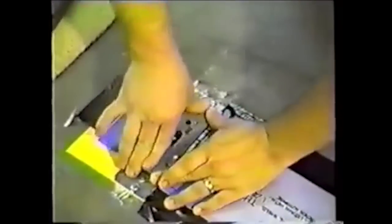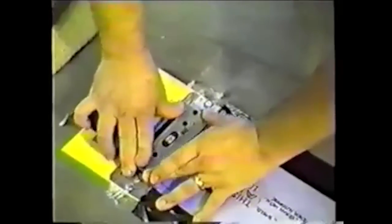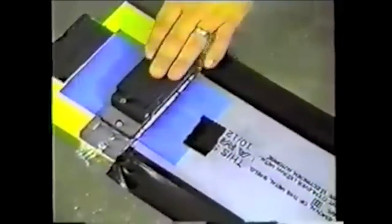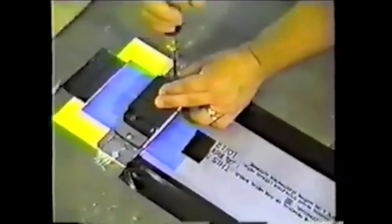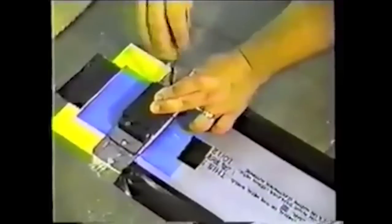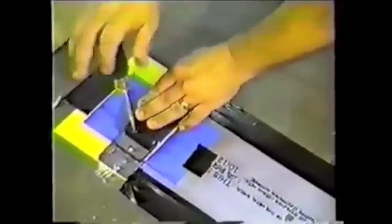An insulator patch is not required when a DCR receptacle or 5-conductor circuit adapter is installed at the end of a circuit cable and the cable is folded up inside the slot on the DCR or 5-conductor adapter. All DCR covers can be installed at this time, but will need to be removed when the carpet is installed.